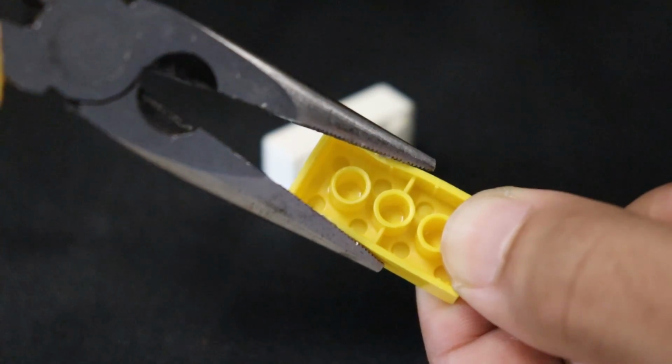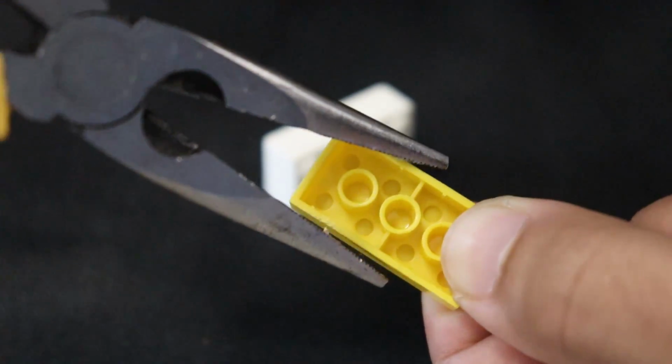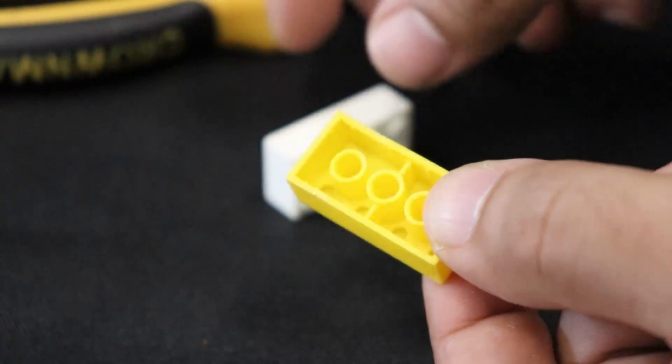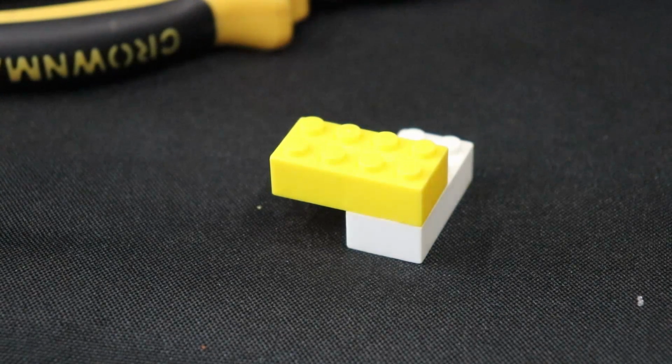And on top of that, the task becomes more difficult when you're making them out of metal instead of plastic, since there's less flex in the material and you can't just shove the parts together and let the walls deform to accommodate for any oversized or undersized mating features.